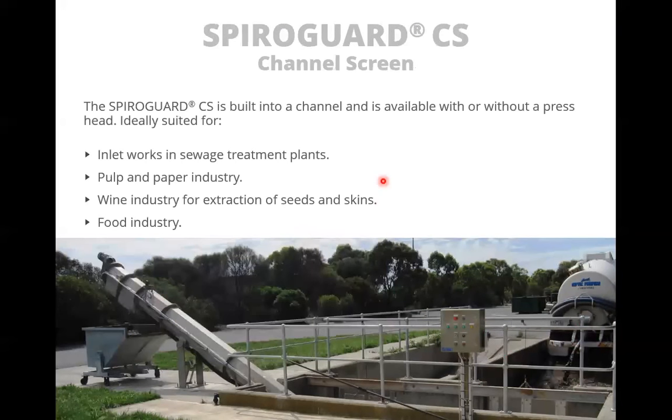Our channel screen is a similar concept, except it has no tank. So what happens here is that it's a conveyor assembly that sits down into an open channel, and water flow travels along and travels through the screen, deposits its screenings onto the face of the screen, and that gets pulled up along the spiral conveyor again and discharges into a skip once again. These are a pulling arrangement, so the gearbox and the drive assembly and the coupling disc and everything is up on the top of it. So this keeps everything out of the water.